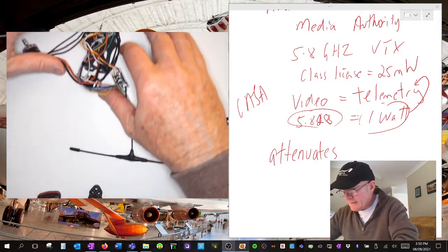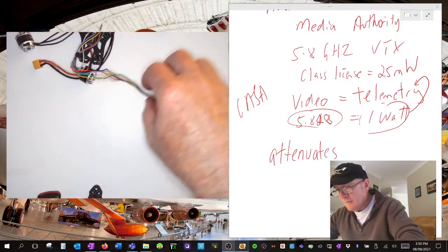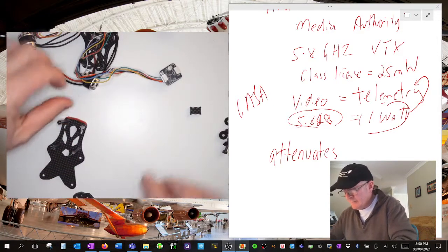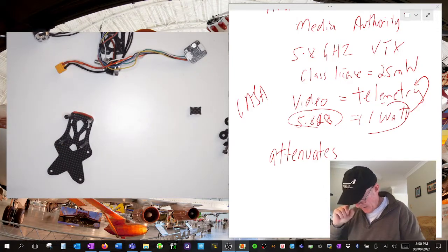Okay, good. Got that down. There are all-the-time considerations about where things are going to be mounted. I want that flight controller to be mounted nice and level as well. It's got to know where the center of the earth is, where gravity acts towards.